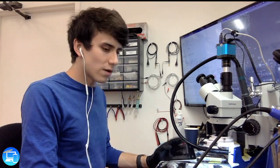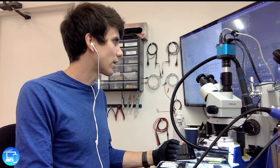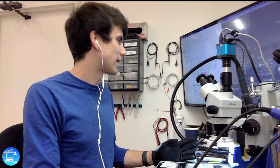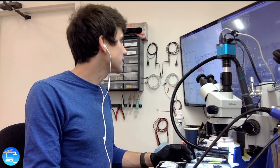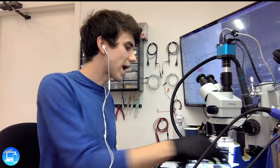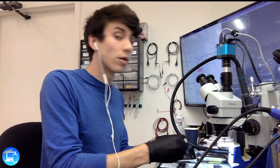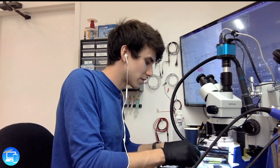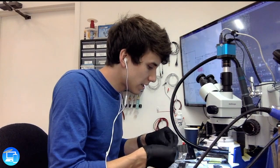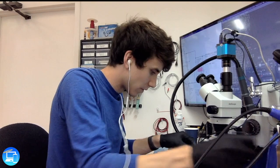To resolve this issue we have to end up replacing the capacitor with the same rating capacitor. However, instead of a tantalum we are going to be using a polymer capacitor. The capacitor specifically is C9560, and we have replacement capacitors here from Louis Rossman's shop online, which is store.rossmangroup.com. He sells special capacitors that fill in the right spot necessary for this job.